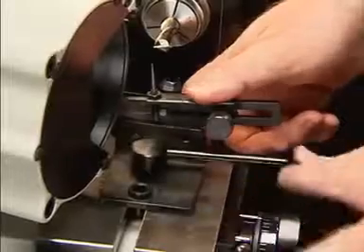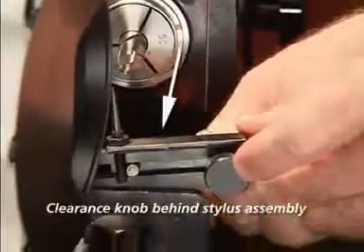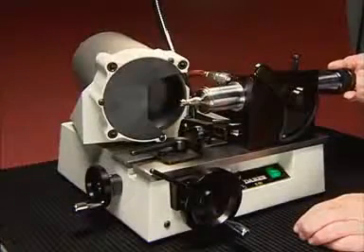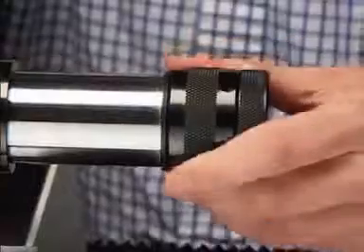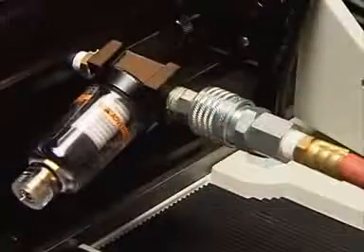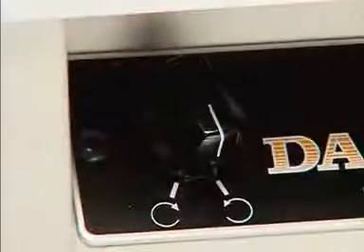This is the stylus adjustment knob. And this is the clearance knob, used to shift between primary and secondary sharpening on the flutes. This is the air spindle. This is the locking dog that locks the spindle in place so you can tighten or loosen the collet. These are the 5C collets included with your purchase. This is the draw tube assembly. And this is the slip knob. This is the spindle lever used to raise or lower the air spindle. This is the index pin and index collar. And this is the connection for the spindle's compressed air with an air filter and water trap. This is the on/off switch, and this is the forward/reverse switch for the motor.